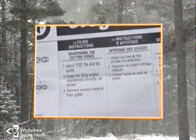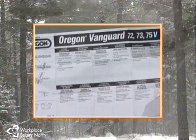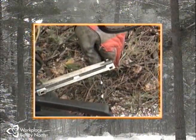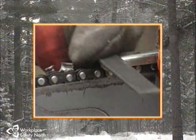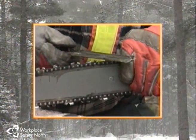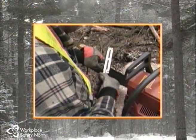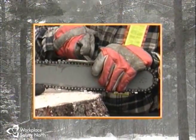To recap: great accuracy in the sharpening angles and depth gauge settings is critical. No one can second-guess the chain manufacturer on what settings are best — rely on your manual. Use the right tools: a round file with handle, the right file holder, depth gauge tool, and flat file with handle. Work on a solid, comfortable work surface. Sharpen on a regular schedule — a thorough job once a day and a touch-up every gas up. Line up the file holder angle markings parallel to the bar, file with long steady strokes away from yourself, and lower all depth gauges at the same point on the bar to ensure uniformity.